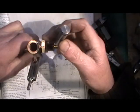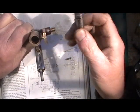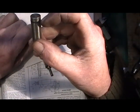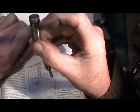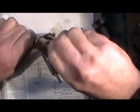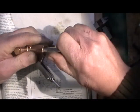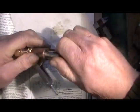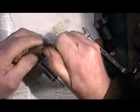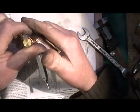I've reamed that hole — that bore — out to half an inch; this is the pump part. I've made my piston, cut a groove and put a number 12 o-ring in, and then that piston is going to fit in that barrel — well, it should do; it's a tight fit.